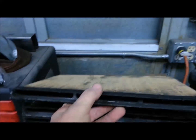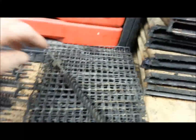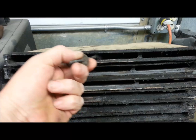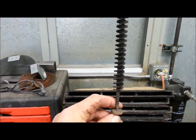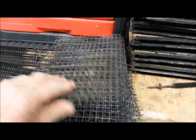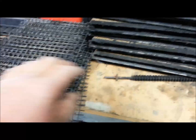This is interesting — they've got these brushes in here, a nylon bristle. They actually sit right inside each one of these bag filters. There's a rod in there that turns these, so it's a manually operated rod. When you turn the rod, these things sweep side to side and clean out the filter. Then there are screens that go in between each filter to keep them from collapsing against each other and choking themselves off.